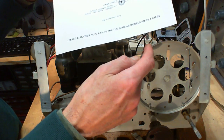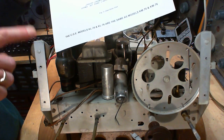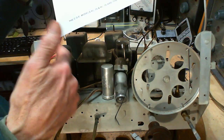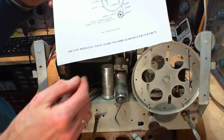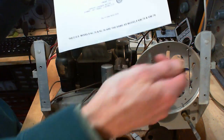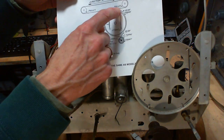Spring up, string. Let me run the string here, up, over, back, and around. When you do these things, the strings fall off these pulleys all the time because you can't maintain tension. As a string falls off the pulley, like in this radio, it just falls right off and you're right back to square one. So I either clip it on these wheels or I tape it to these wheels as I go over. All about keeping calm and cool.